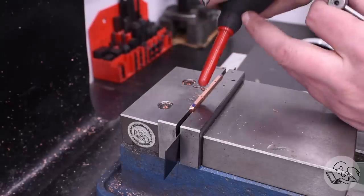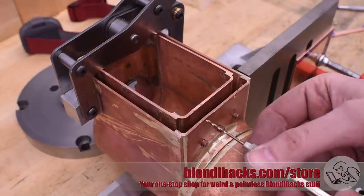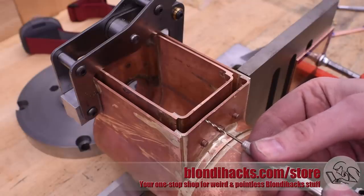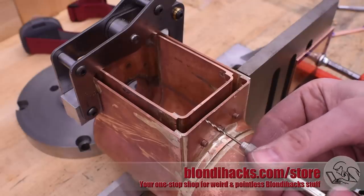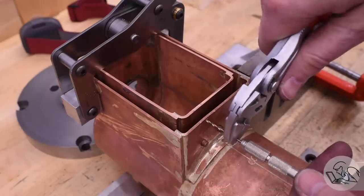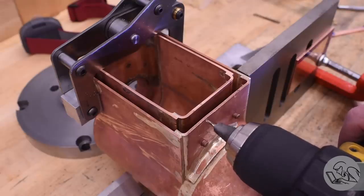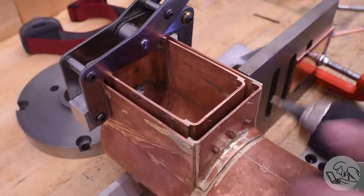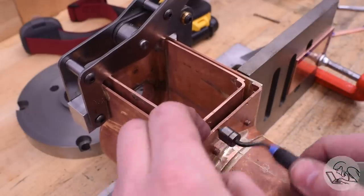Foolishly, however, I drilled the holes in the sheet metal with the tap drill size and not the clearance drill size, which was fine for marking the positions, but now I need to open them up to clearance drill size. And this is where the pin vise lets me down — the drill gets so grabby when trying to open up a hole in copper that the pin vise isn't strong enough to hold the drill and it just slips. I tried a few ill-advised things, but none of that was going to work. I broke down and tried the hand drill, and actually this worked just fine. I choked up the bit to keep it from marking up the firebox on the inside — I should have choked it up a little more, but this basically worked and I got the holes opened up. It turns out I should have just used the hand drill from the beginning, probably. But think of all that character I built — and you can't put a price on that. That's my story and I'm sticking to it.